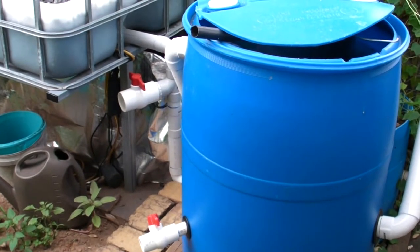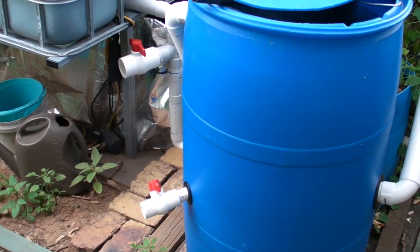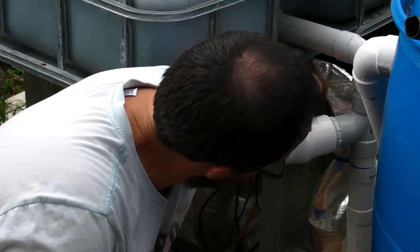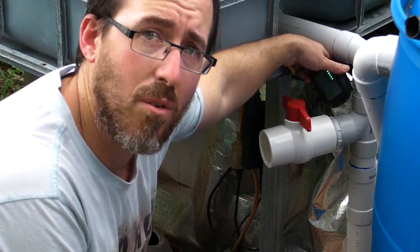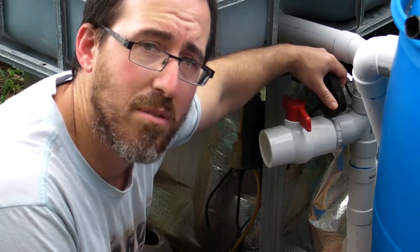What I'm going to do is run over there and tap down the bottom. I'll just open that up — I'll pause the pump first. Open up that bottom tap and let a bit of water out of the radial flow filter, just down here. I've got the pump controller so I can turn it up, turn it down, or press the button — it's a feed button. It stops the water at the fish tank and it'll keep going in the grow bed for a while. I've stopped that water and I'm going to take out the sediment lift outlet.